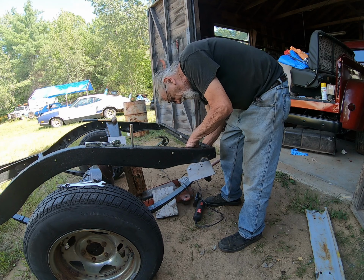Okay, we got a 3/8 inch drill, because it's 3/8 inch bolts, so I don't know if they're gonna fit too good. I may have to give it a few thousandths extra. An inch. Set it on 0. And ready to drill the second one. All right. Let's move this way a little bit.